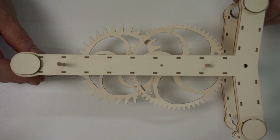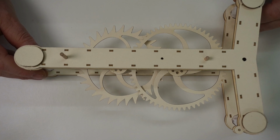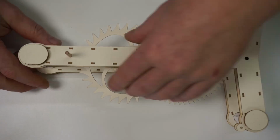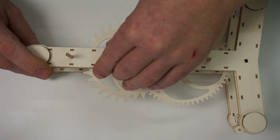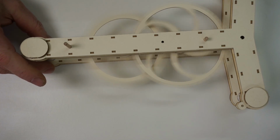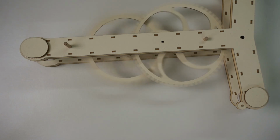When all the parts have been made, it is time to test the gear train. Start by inserting the intermediate cog and escapement wheel. Also add the frame nails to ensure the front to back frame gap is correct.